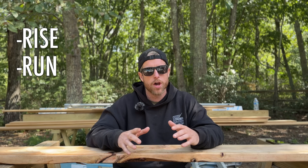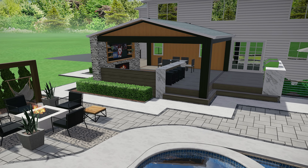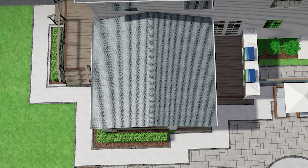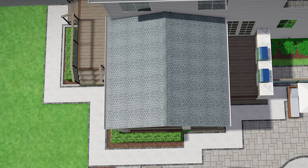The most complicated thing about doing any roof structure is figuring out your measurements — your rise, your run, and your pitch. We're going to get into that in a bit, but we're going to start with our foundation, which is our posts. The project we're talking about is building the roof over top of a deck structure. The deck has been designed to handle this load. If you were building this as a standalone structure, you would put each one of those posts onto a dedicated footing. We've got a 20 by 20 roof structure that we're building on top of this deck.